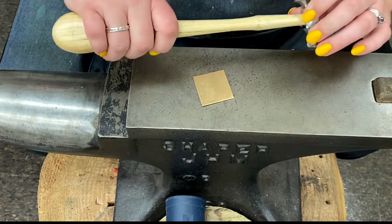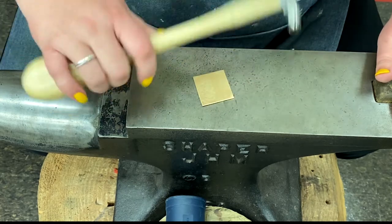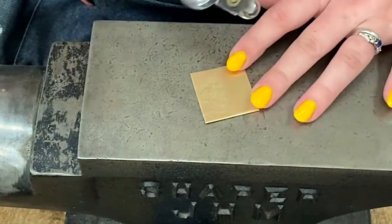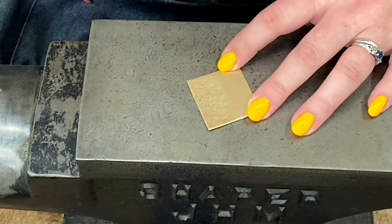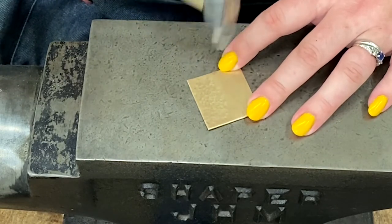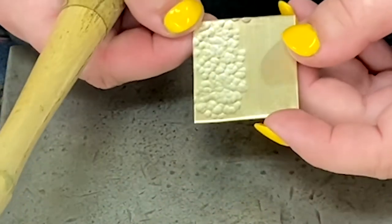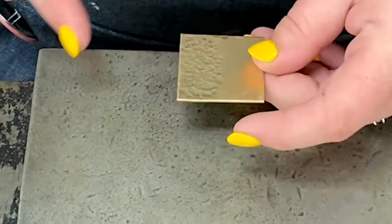Grab it where it's meant to be grabbed — back here. You want to throw it and then catch it. Your arm and the hammer should have this motion. If your arm is doing all the work, we're not letting the weight of the hammerhead do the majority of the work. Just let it fall and then catch it. You can even hear the difference between doing it right and doing it wrong. Look at that — that's just with the ball peen hammer. You can see up here where it's kind of started to deform a little bit.